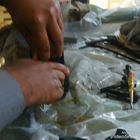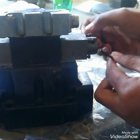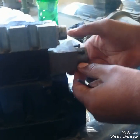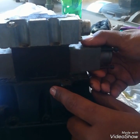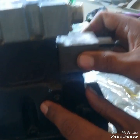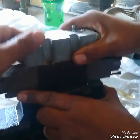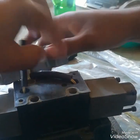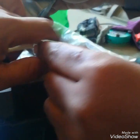The electronic circuit of this proportional valve, as per the set point, changes the coil supply so the oil goes to the reverse or the forward side of the hydraulic jack. I am removing this coil — it produces a magnetic field to move the spindle reverse and forward, so the main spool moves and the supply of oil changes to reverse or forward for the jack. Here you can see many cables for the supply of the coil — this is a 5 volt supply; this coil is operated with 5 volts.